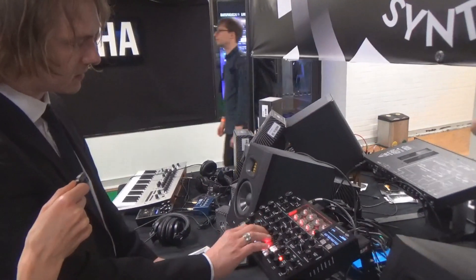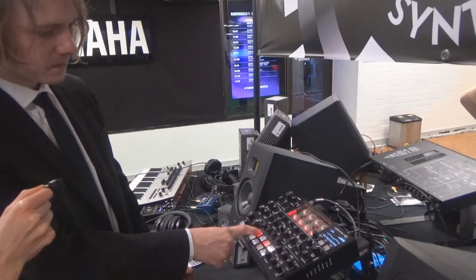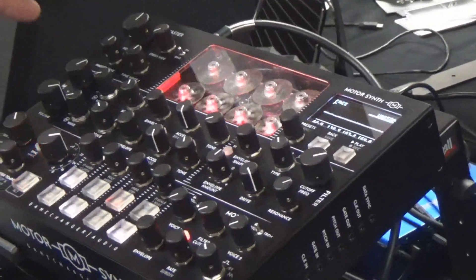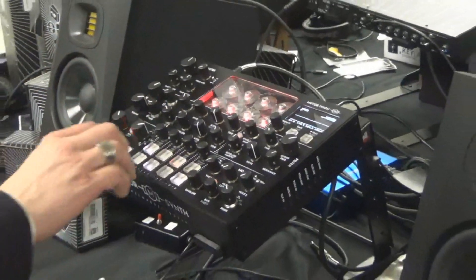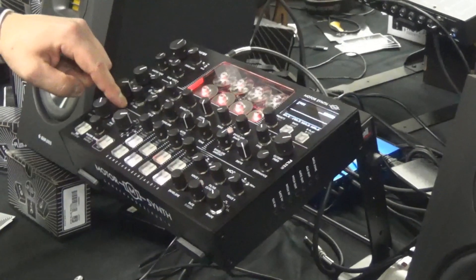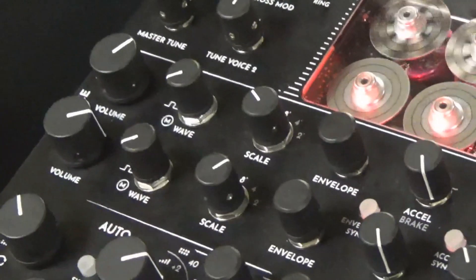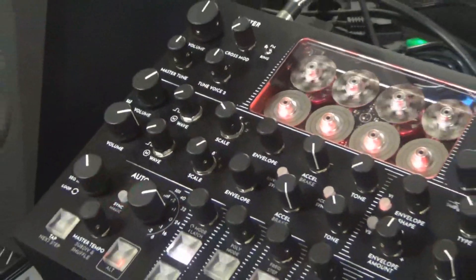So here I have these little mini keys. These are two modes — the synthesizer is a four-note polyphonic analog electromechanical synth with two voices per key. So here I have a low voice and a high voice, and I can select the waveforms for each one of them. Right now they're both set on the motor waveform. If you can film that, you can see there are little symbols of wave shapes. The M wave shape is the electromagnetic energy picked up by a little inductor — that occurs naturally as the coils in the motor are spinning.